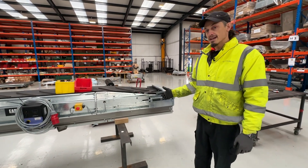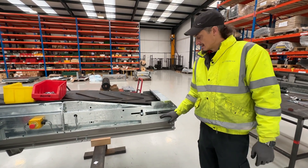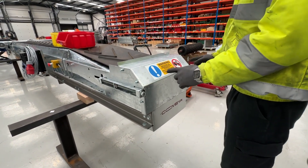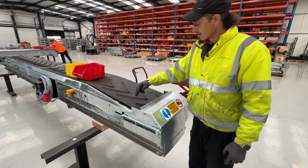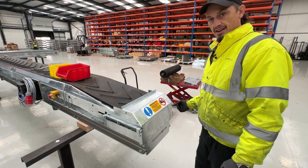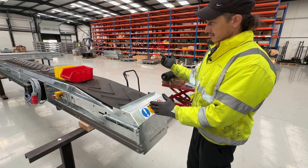On the EasyKit 450, it has a slightly different style of tracking system. We're not tracking on the side of the tail or touching any nuts and bolts there — we're tracking right at the back of the tail. We have this nut here and this nut here which tracks the belt from left to right. If the belt was moving over to the right hand side, I would tighten up the right hand nut, which would move the belt to the left — just tighten it a couple of turns at a time and then watch the belt move with the conveyor running.